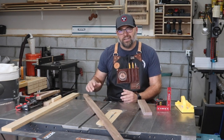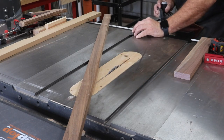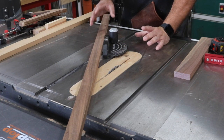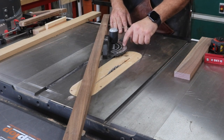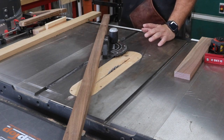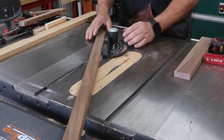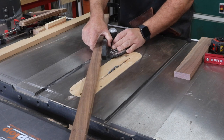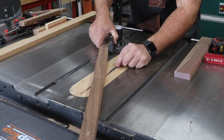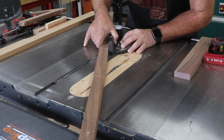For our fences, we're just going to use a couple of straight edges. You need them long enough to go across the table saw diagonal — other than that, it doesn't matter what you use. With my blade still at its final height and my machine unplugged, I'll set my miter gauge in place. The miter gauge is really good for determining your angle with your board. I like to set mine at 30 degrees — it's what I've used when I made the jewelry box and other cove cuts, and it seems to be the most common angle used. With the miter gauge set at 30 degrees, I can put my fence directly up against it, giving me a 30 degree angle to the miter slot. I can slide it into place making sure it's about a quarter of an inch offset from where the saw blade comes out of my zero clearance insert.